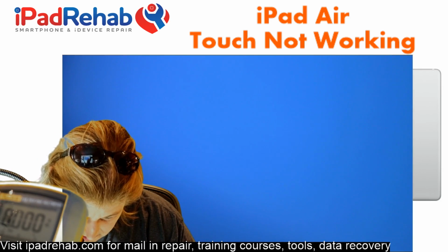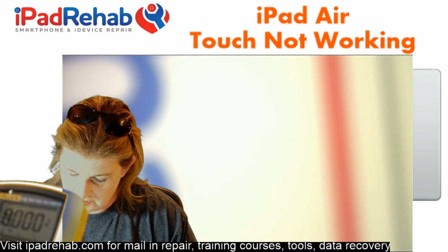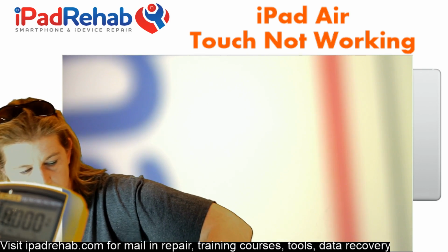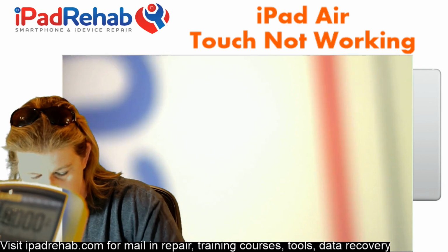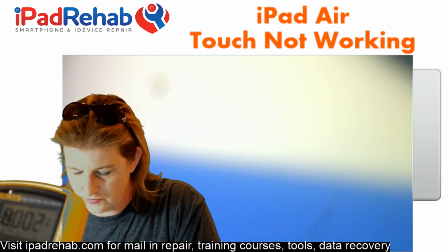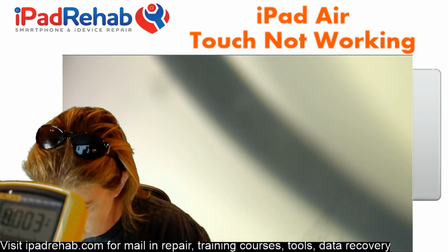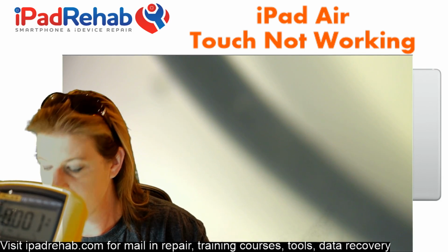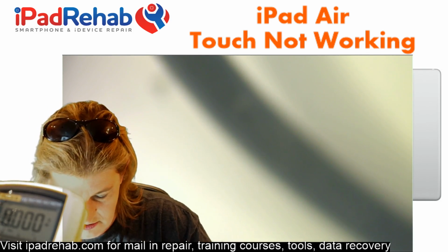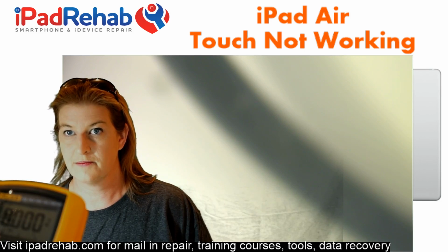So I'm going to plug in this digitizer. I'm going to disconnect the iPad and press it back onto the battery. That's a terrible thing to do to an iPad, to not get really serious about the battery connection, but we're in a hurry. All right, let's see if we can prompt it to boot. No, I want you to turn off all the way and reboot. All right, lift up battery, press down battery, and close that.